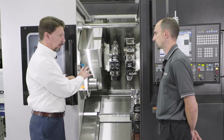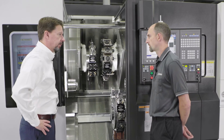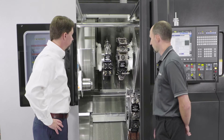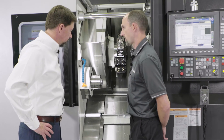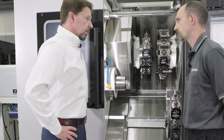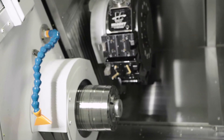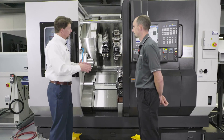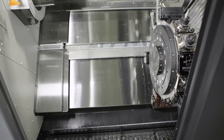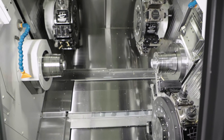What other things do you see from the enclosure aspect that makes Okuma successful in an automation environment? This machine has two dedicated coolant pumps just for flushing chips. We've got nozzles on each of the three turrets to help keep the X-axis way covers clean, one on each side under each spindle for the Z axis, and also lines to help reach into some of the corners. Combined with the steep angles of all the sheet metal, we do not have opportunities for chips to collect and cause issues.